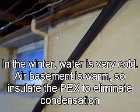So we've gone into the house now from the outside. You can see we go through here. I insulate the pipe so that condensation in the wintertime won't cause water to build up in the house. You get the warm air in the house, cold air, cold water coming in — that would create dripping, which you don't want. So we put the foam insulation on there.